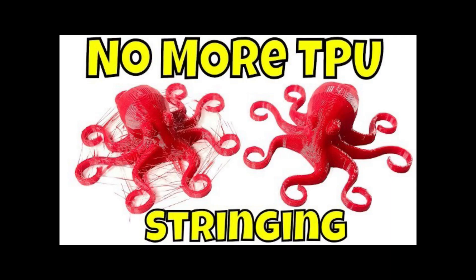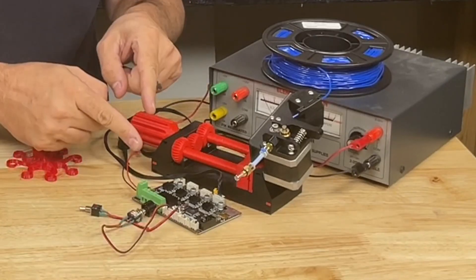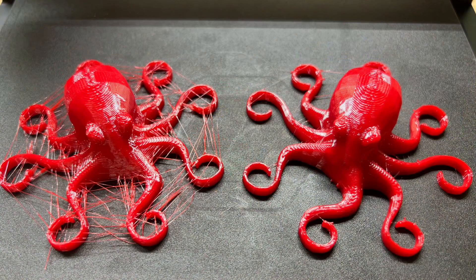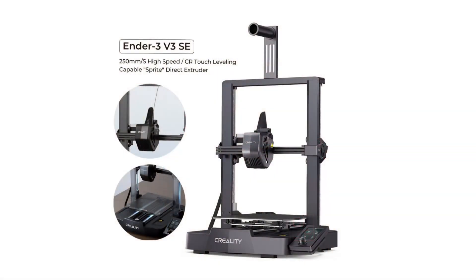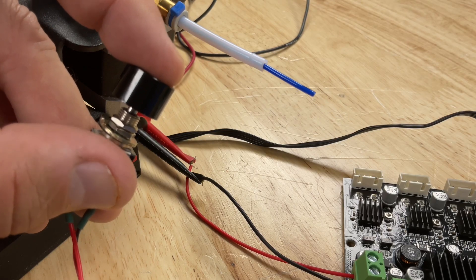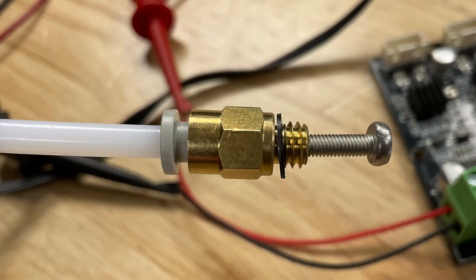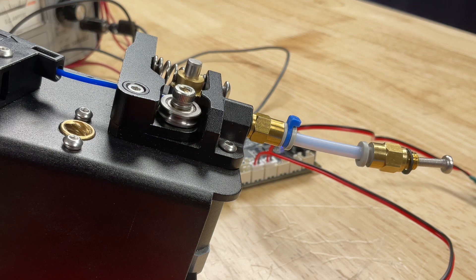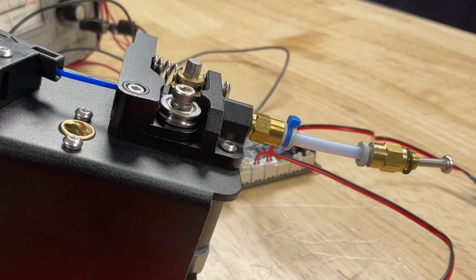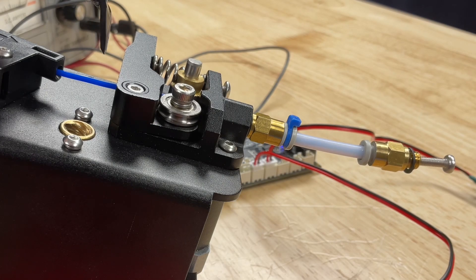I'm going to use my setup from a previous video where I use an older Ender 3 board to drive an extruder with some custom Arduino code. With that I was able to take a really stringy octopus and turn it into something that barely had stringing on an Ender 3 SE. With a push or release of a button I could extrude or retract filament. I put a block at the end of some PTFE tubing and pushed the filament into it to compress it. First I did some baseline lengths — stopped it, cut it — to measure against, and then ran it again driving as hard as I could.